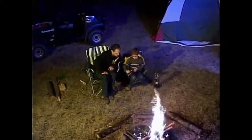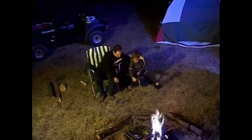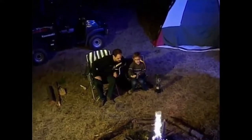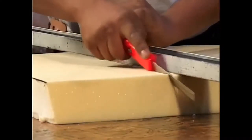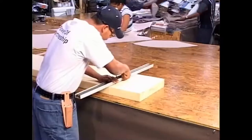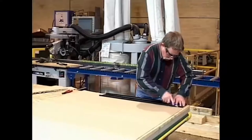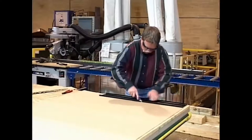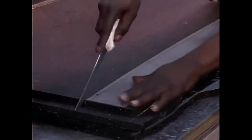Another safety tip for preventing injuries while using knives is to maintain an awareness of where your body parts are located relative to the path of blade travel. We've all heard the advice to always cut away from our body — it works well for whittling a stick, but is usually very awkward in most industrial applications. When cutting on a flat, stable surface, the most powerful and efficient cutting motion is towards your body. Stand or kneel slightly to one side so the path of blade travel is not directed at your body should the blade slip. Cutting at a 90-degree angle to your body is also a safe, powerful stroke. When using a guide, be sure to keep your fingers well out of the way in case the blade rides up onto the guide.